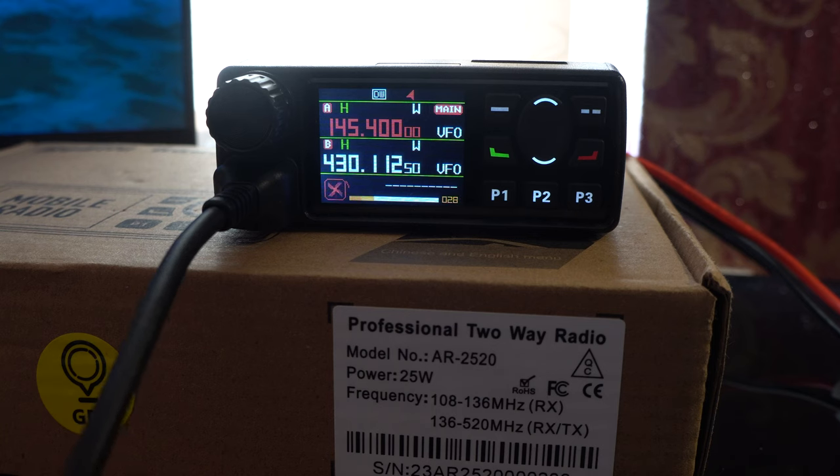I'm really pleased with how good this radio is for the money. There are some firmware issues with the menu system and scanning, but apart from that it's all good. The fan has just kicked in on this radio and the little fan symbol is spinning round in the bottom left corner of the screen. Before the firmware update the fan symbol used to spin but nothing actually happened. Since firmware version 1.08 it's cured the issue. I've got a little fan noise coming out the back keeping it cool — I put my hand on top and it's not getting really warm, even on high power at about 20 watts.